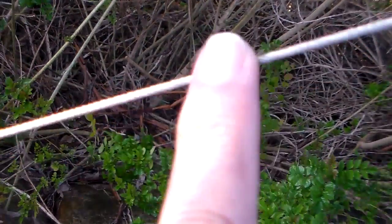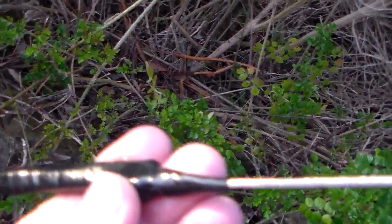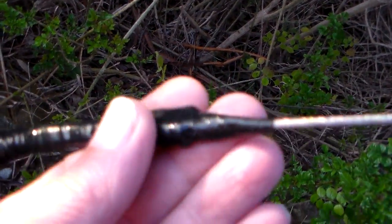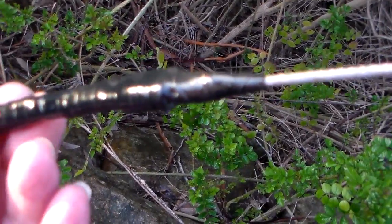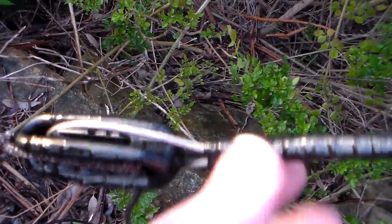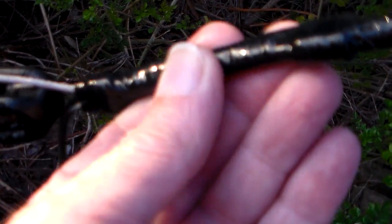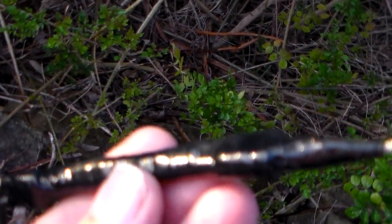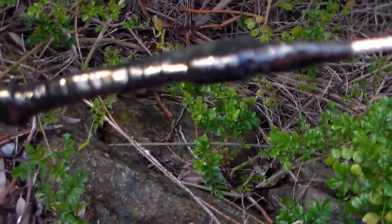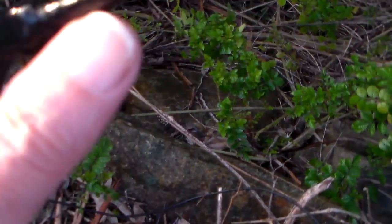There's the steel wire. It comes down, there's the swage there under that tape, and that goes down and there's another swage there because the steel wire loops around the insulator, back through the swage, and that's just swaged on there. This is where the copper wire comes up and goes into the swage — it actually goes into that one there.